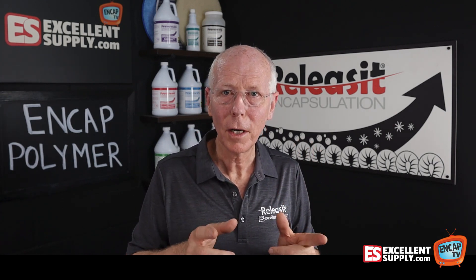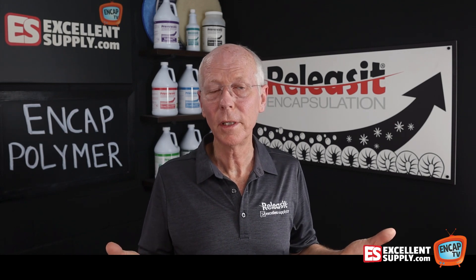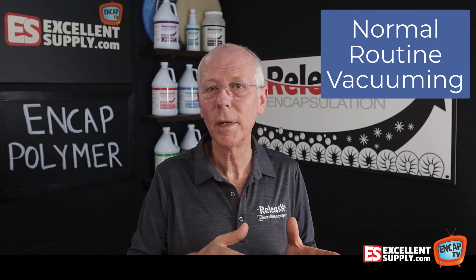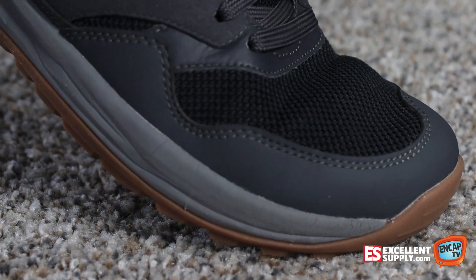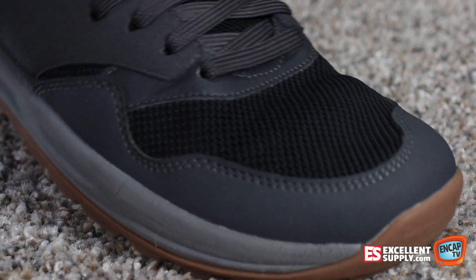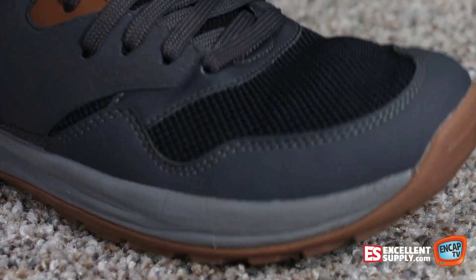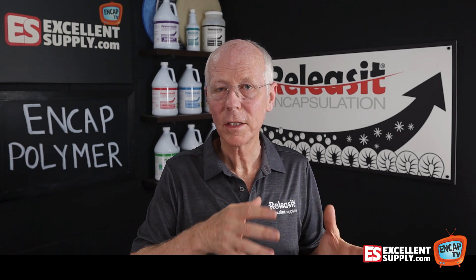How do we get it out of the carpet? Sometimes carpet cleaners will ask if they should come back and do post-vacuuming. That's certainly an option, but if the building has a regular vacuuming program in place, routine vacuuming is what it's going to take. Through the course of normal routine vacuuming, the encapsulated soil will continue to be recovered from the carpet. Another way it's recovered is that carpet fiber is flexible, while the brittle encapsulation polymer is very brittle. As people walk on the carpet, the flexible fiber will flex and the encapsulation polymer will shear away from the fiber, then be recovered with normal routine vacuuming. The soil will also release with foot traffic, so that combination works together.